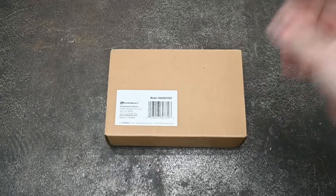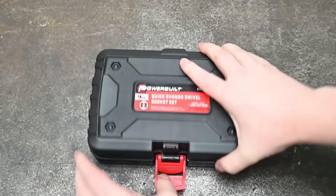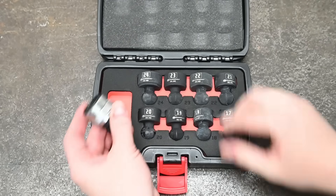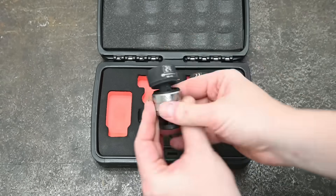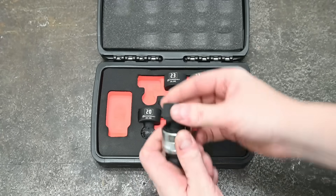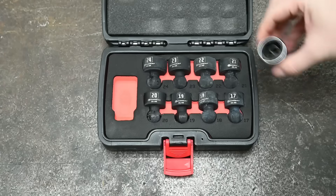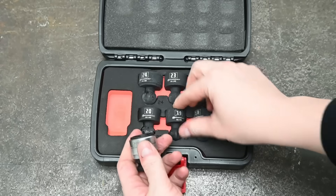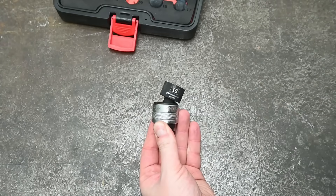In order of price, starting with a few new entries to half-inch before moving on to several 3/8" drive examples. We have the strangest looking set of impact universal sockets I've ever seen, from Power Built. Pretty much all these pieces are half your usual universal socket pairing — the silver part is a retaining sleeve, and the base socket can be used on each and every socket size in the set, spring-loaded inside to make what they call their quick-change sockets possible. It articulates pretty freely, maybe even a bit loose. We first saw these as a new Cornwell socket set a viewer linked to us.